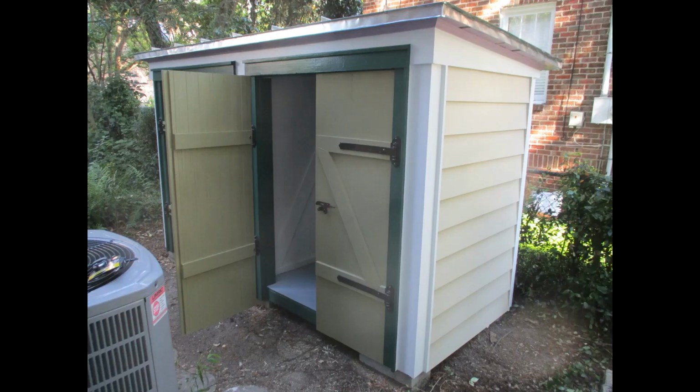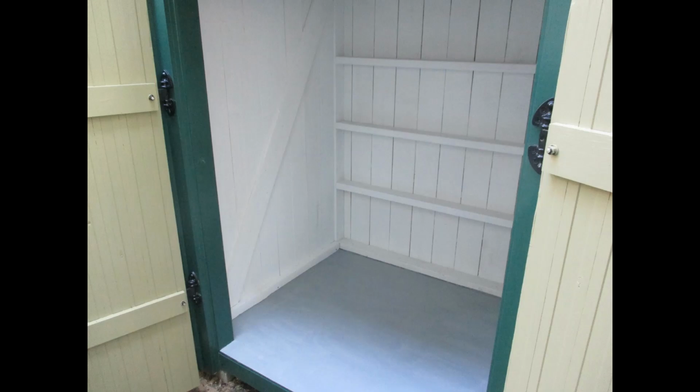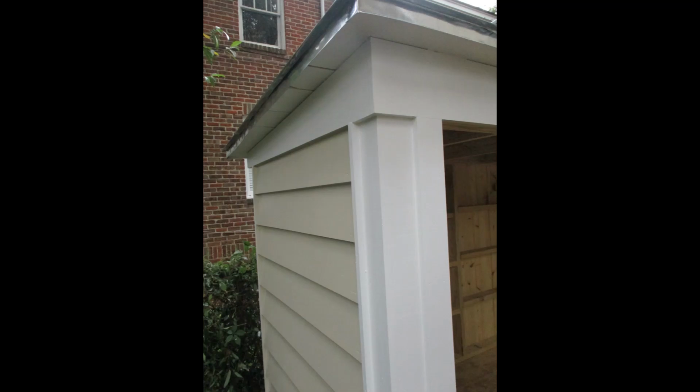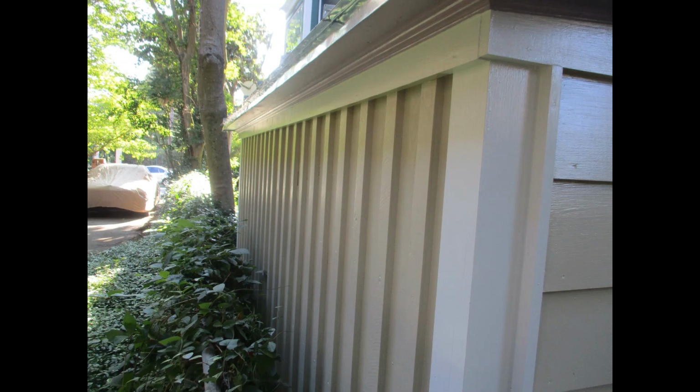Now the interior, how I divided it: I wanted to use every inch of space, so I didn't build out a stud wall to divide the two halves. What I did was use that same fencing board, and this time I cut a half lap in each board so that they would overlap each other, so when they shrink you would not be able to see between the two units. Here's a little close-up of how that corner turned out, the board and batten in the back. It really looks nice. Each of those boards was like $1.25 or something, so that was the cheapest wood I think I have ever purchased in my life. And it looks good. There's no example of board and batten in the house, so I'm not reflecting the house. I was just reflecting being cheap, I guess.